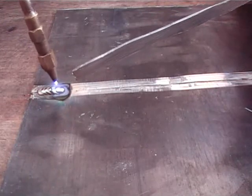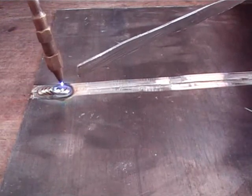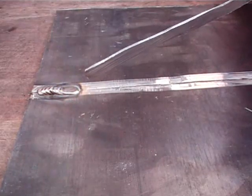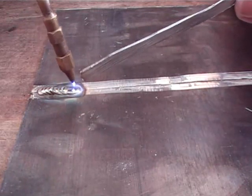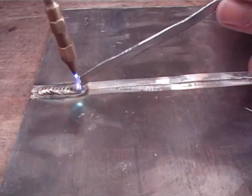I melt it down — I preheated the sheet before I started, by the way. See that dimple appear when it solidifies? I melt down 2mm off the rod onto that dimple, then wait until it's reached the width of the weld and push it forward 2mm.